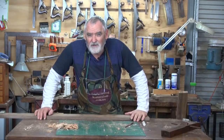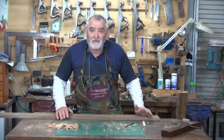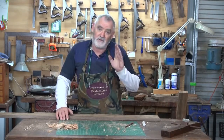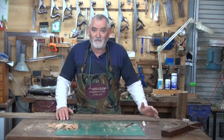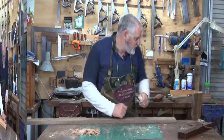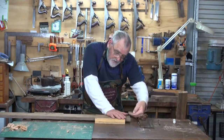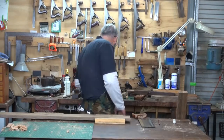As a matter of fact, I think I'll go about 920. I said I'd keep these at 900, but the reason I'm going a little bit longer is because I'm going to have to hand plane this, and I don't want to get any snipe from the hand plane — that extra little bit at the end will give me a clean cut. Normally I would do a knife cut and then lead in with a chisel. In fact I'll do it anyway — it's a good habit to get into.